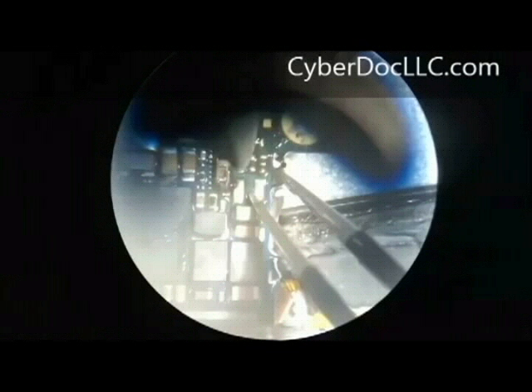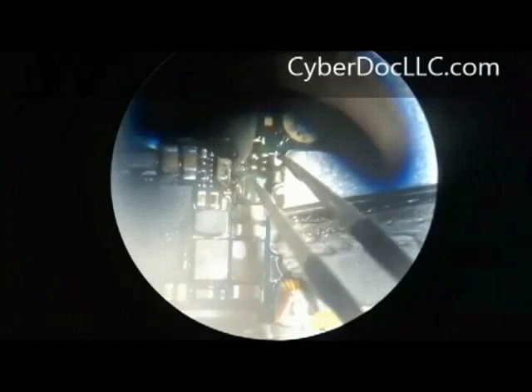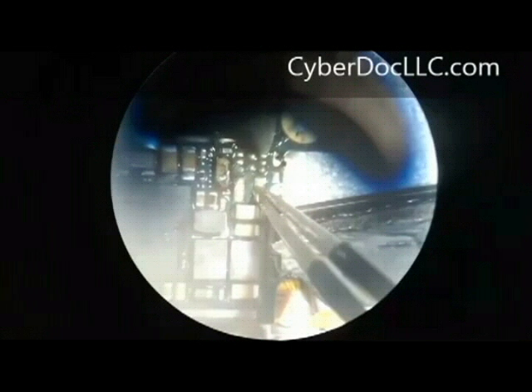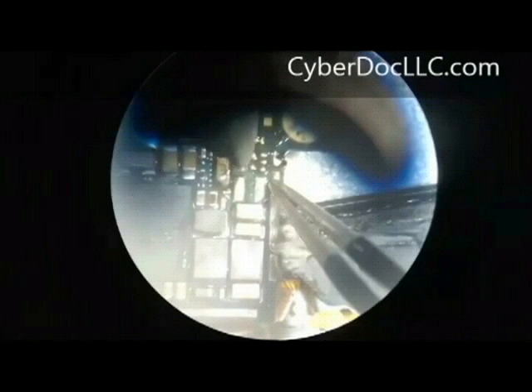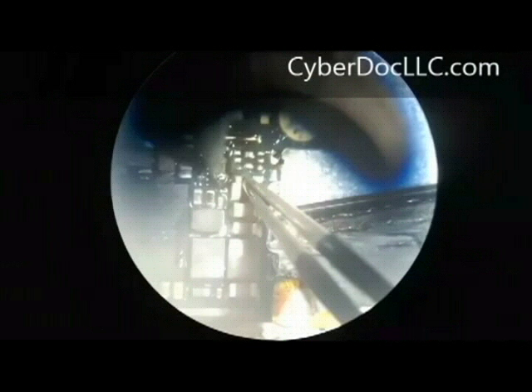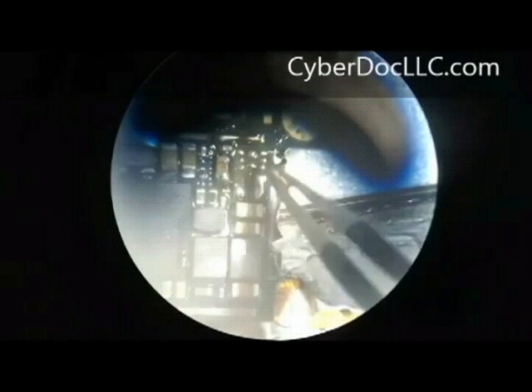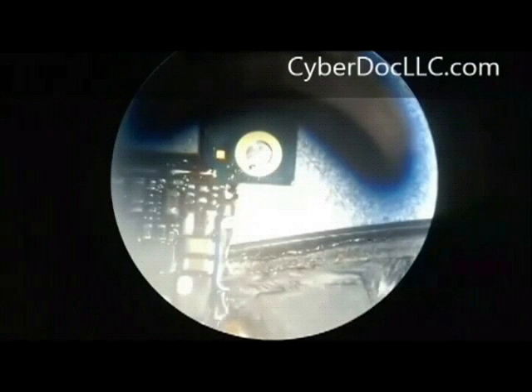Don't be afraid — this is very easy to remove. You just need a small enough soldering iron with a fine tip. If you want a really fine head, you can buy one or grind it down yourself with a stone or machine — you can sharpen the tip essentially. That will unbridge whatever bridge you make. Since this quick alloy is just like liquid, you can sometimes use solder wick to remove the excess solder alloy that you put on.